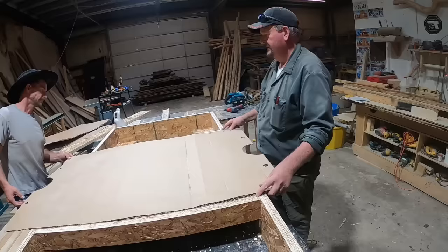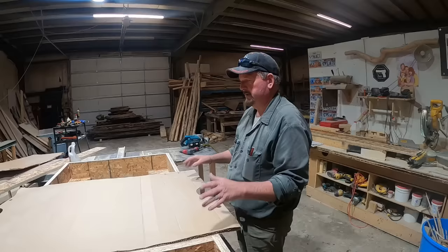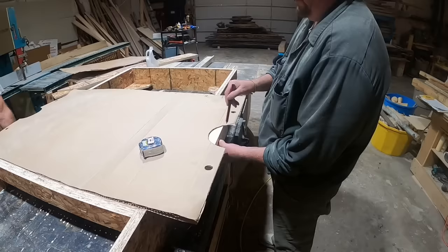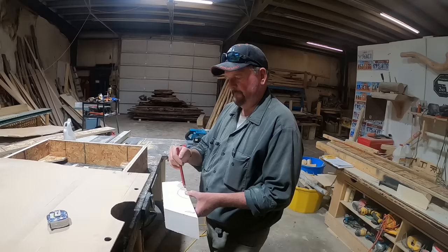Money, money. So when you bolt the slate on the frame, they're kind of angled, so we're going to be able to go down through our braces. We're all square. This is a pretty dang nice base. Our sides are 4 inches thick. So see this right here? That's how much of the side we're going to have to dish out. And then the pocket goes right down in that, and then you screw the leather pocket to what you've dished out. So we're on track.